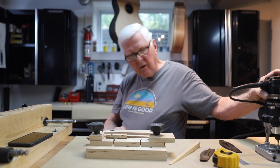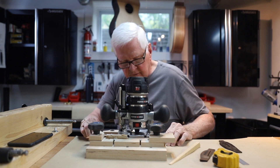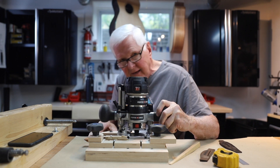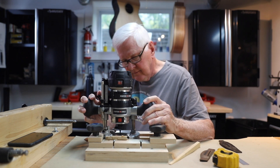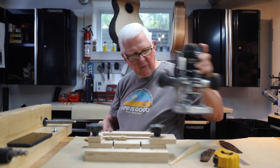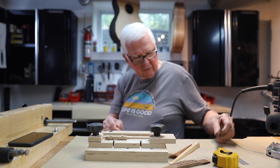With the plunge router, I'll take this thing, bring it down to the wood with the lever, and I've entered the wood. You've got to think about the depth — it's probably three thirty-seconds of an inch to an eighth of an inch. Once you're in and it's running, you plunge it down, you simply slide it very slowly across the wood, and you're done. Take it and lift it. It's just coming across, then raise it up, turn it off, let it stop spinning, and then take it away. You've got your slot right where you want it. This is a finished one that I've done, and I'm going to use that on the next guitar. That's another finished one.